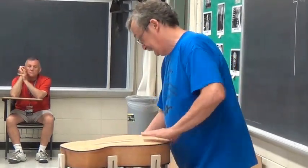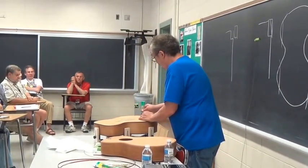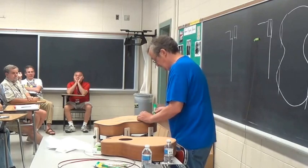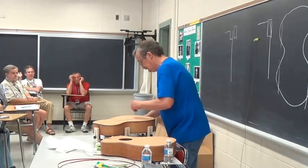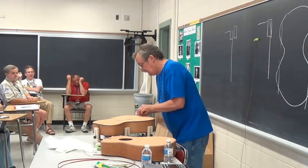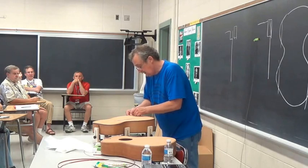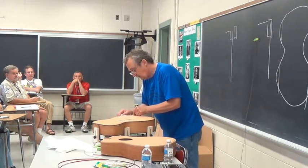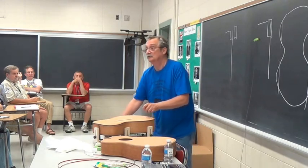So the handy bottle of thickened lacquer comes in big and handy for when you're doing any kind of drop fill. Is that what the Duco is? The Duco is an acetone-based product, but it's not lacquer. Lacquer, nitrocellulose, we're talking nitrocellulose lacquer.